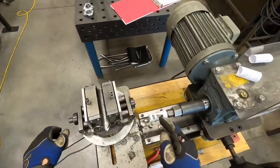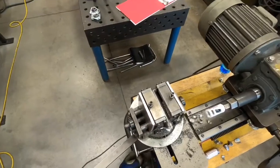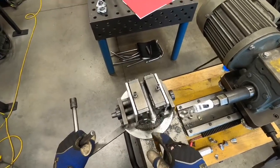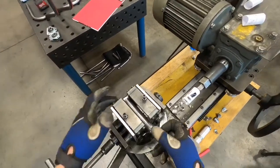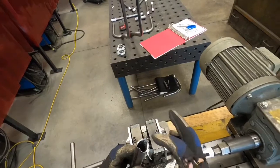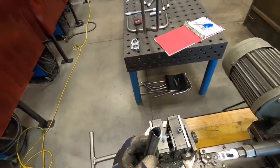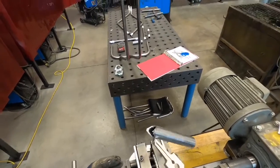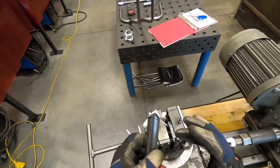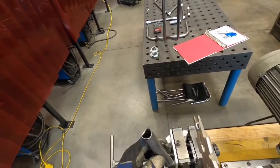Back it away from your tube because that thing could be pretty toasty and you don't want to accidentally hit your knuckles on it. Now the next safety thing - a lot of kids get cut. I usually wear nice tight-fitting gloves when I'm doing this, just because I've been cut before by these edges. They are pretty deceiving - it looks like it's just barely hanging on to that tube, so in your mind you think 'I'll just grab it and pull it away.' Never grab these pieces with your bare hand. Always use a pair of pliers to pull that off. I've had it where I went to pull it off with my glove and those edges are serrated - it cut through my glove into my finger.